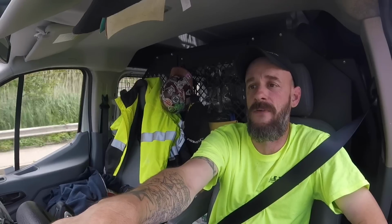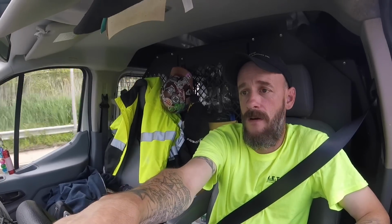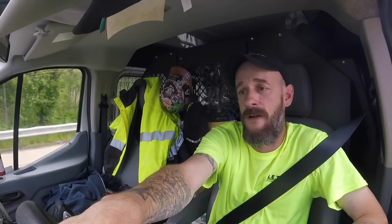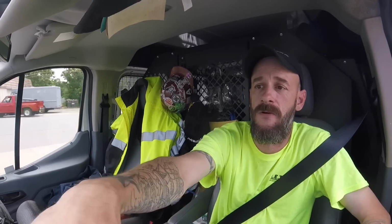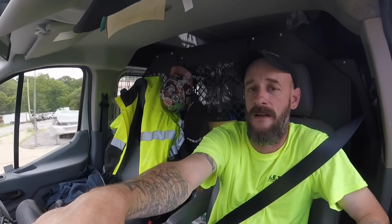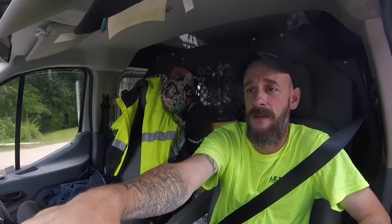And, you know, always do the fronts, the fan guards. You can't just do the back, because then the front still looks like crap. You want to do a nice job with them. And always remember to angle that hose down, like angle it down always, because it helps to get the dirt out. You know, thicker coils with that. It's not like air conditioning stuff where the coils aren't as thick or anything. But even with those, I always angle it down. I try to tell everyone that I've worked with over the years, angle it down.